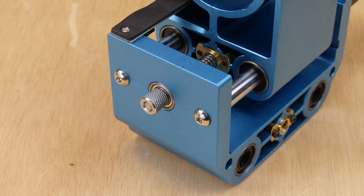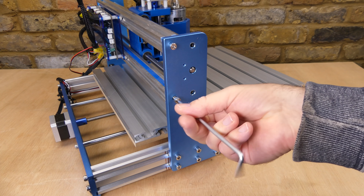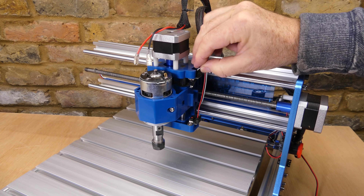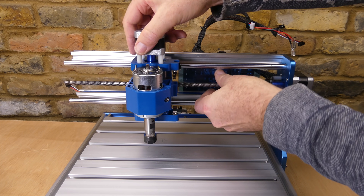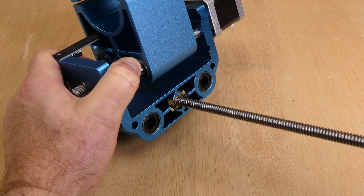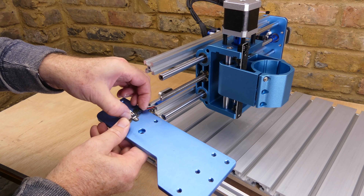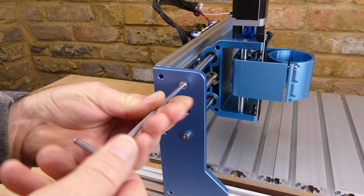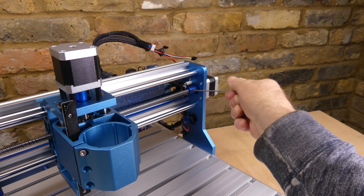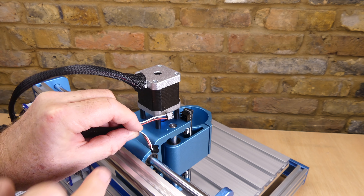Next I installed a 52mm diameter aluminium spindle holder, which is a complete new Z-axis assembly. The spring in the anti-backlash mechanism is compressed while the lead screw is installed, which should result in a slight gap under the screw head. The old spindle motor cable can be removed before reinstalling the stepper motor and limit switch cables.